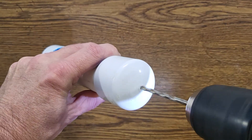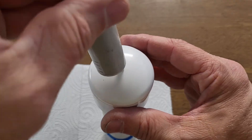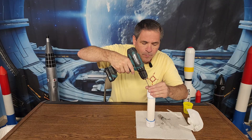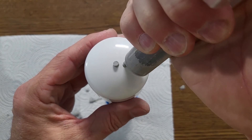I'll start by drilling a small hole in the top of the end cap. In hindsight, I should have drilled that hole before attaching the cap to the PVC pipe — not having an air release hole made it a little difficult to push the cap on. I'm going to use a plastic syringe to inject anchoring cement to fill that air gap. Actually, slight change of plan — I'm drilling two holes, because with just one hole the syringe blocks the air coming back out. So we need a vent hole right next to it. Now we can fill from one hole until it comes out the other.